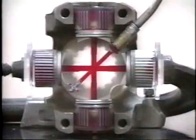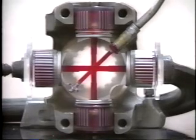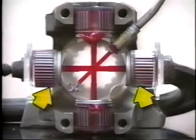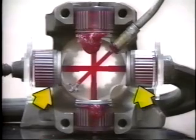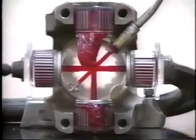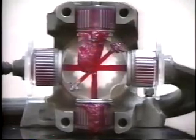This is an illustration of greasing a universal joint with unequal seal pressures due to tolerance stack-up in components. This can result in not all seals purging. In this case, two seals purged and two seals failed to purge. Notice the bearing seals that did not purge failed to get a complete fill of lube path. These voids can cause an insufficient lube condition and premature failure. This is why it is essential for all bearing seals to be purged.